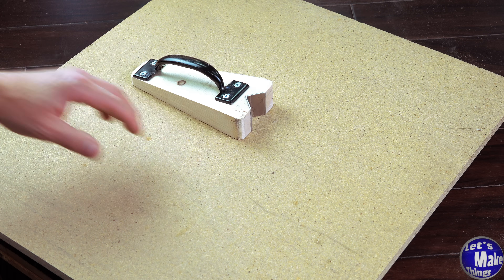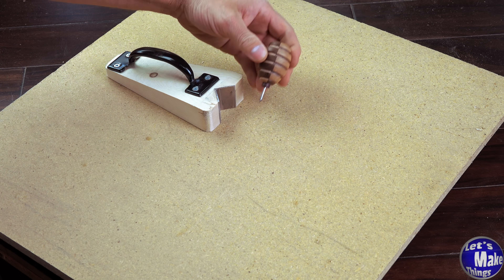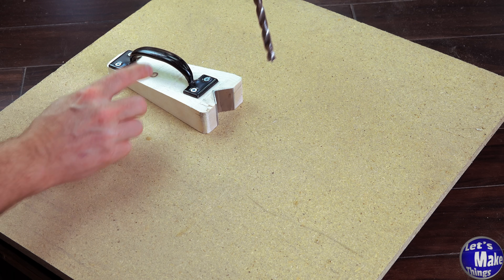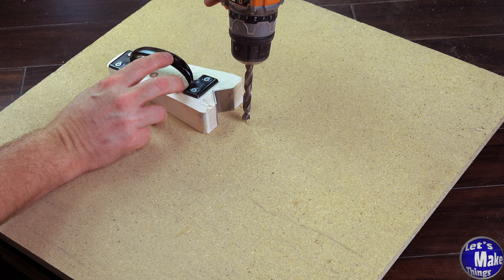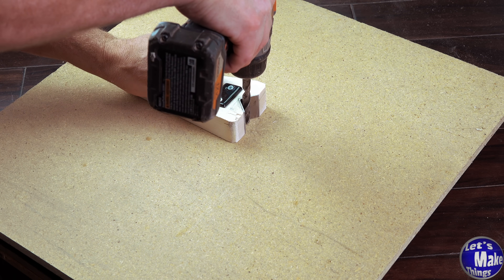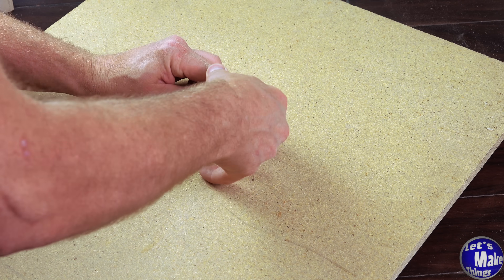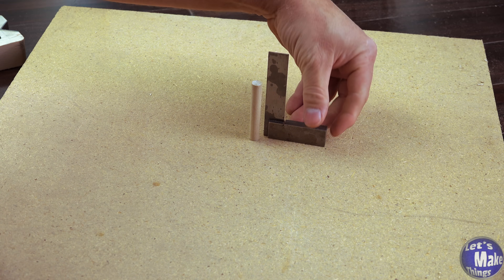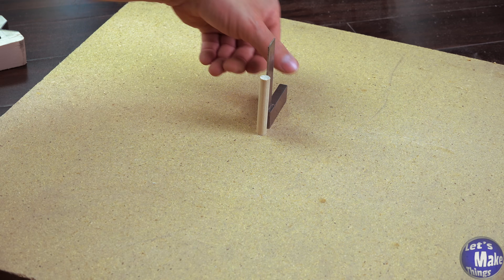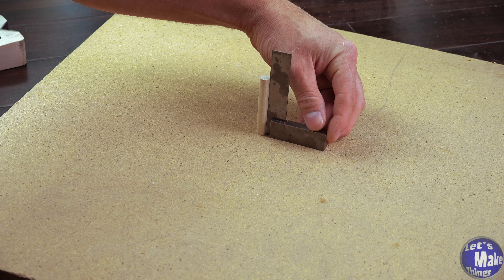At this point, all we need to do is set it on the surface that we want to drill a hole in — this is something that I wouldn't be able to fit underneath my drill press, so it's perfect for this. I'll use an awl to make my mark, then take my brad point bit and put that right inside of that hole. I'll butt this up against it and drill my hole out. I'll add a dowel and check how straight it is — and it looks pretty straight. I'll flip this around and check this side now — and that looks pretty good as well.